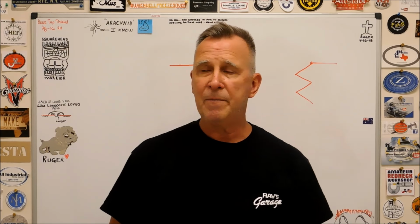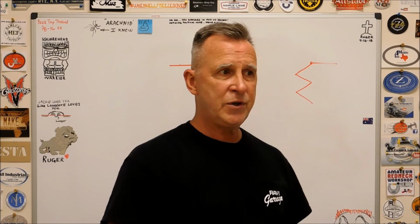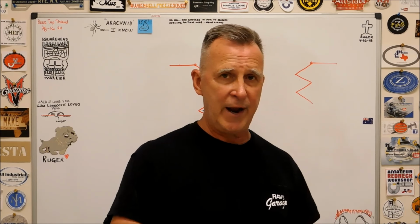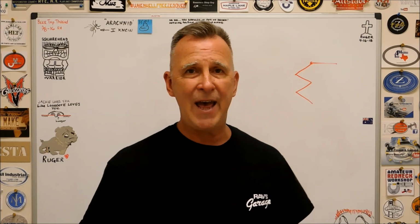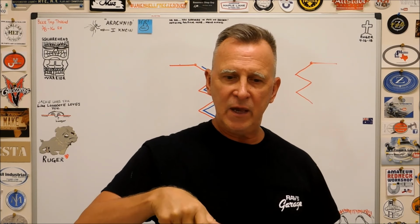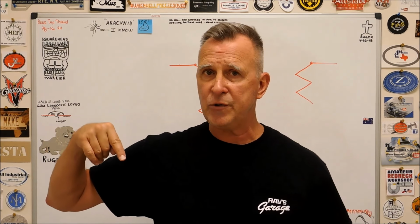Never been a fan. I would say that they do have their place, but they're for screws that aren't going to argue about coming out. Okay, they just broke off for some reason, maybe you stripped something out, you want to drill it out, boom. Use a left-handed drill. Of course, everybody's going to say that, but when you use a left-handed drill and you're coming down on the part, if the drill grabs the screw, in theory, since it's turning counterclockwise, it's just going to walk it straight out.